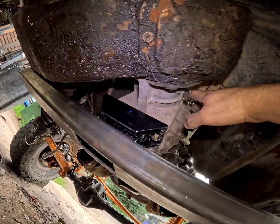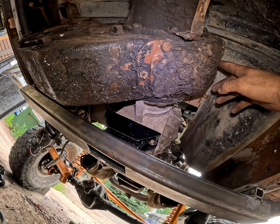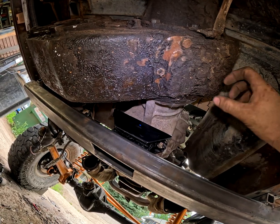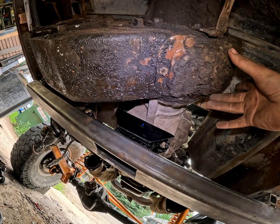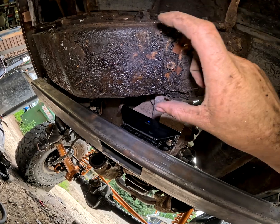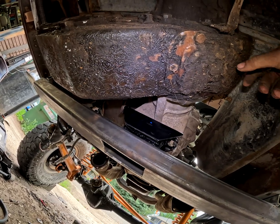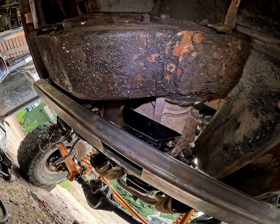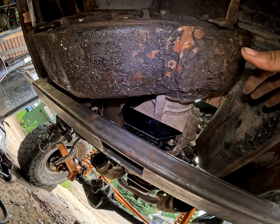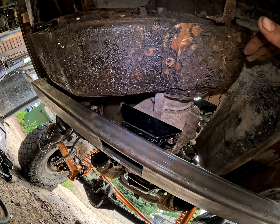Now, because this is an aluminum tail housing on this transmission, and this is a 100-and-something pound cast iron T-case with all metal gears, what I'm thinking I want to do here is build a bracket that will bolt off of either the PTO cover itself, maybe replace the actual PTO cover with our own bracket, and then we'll have 2 ears coming out with gussets. Then we'll put a bushing right there, and we'll tie it to the top of the frame over here, so that when the engine and transmission flex a little bit, the T-case has something to hold it in position and not break stuff.